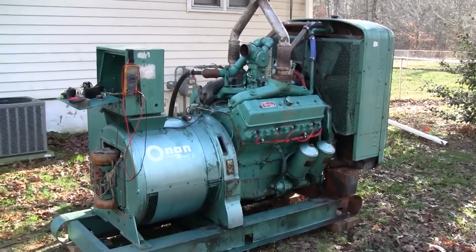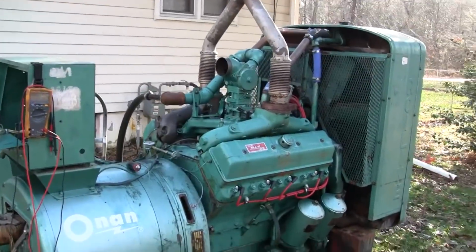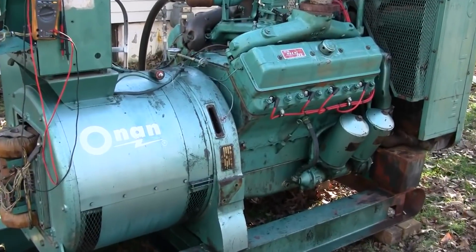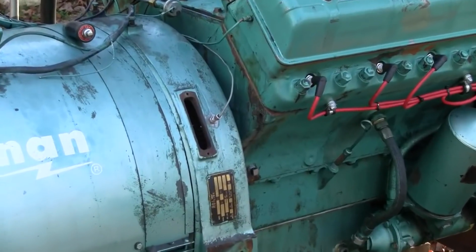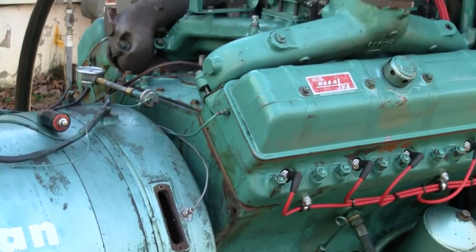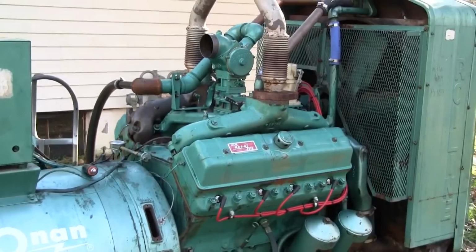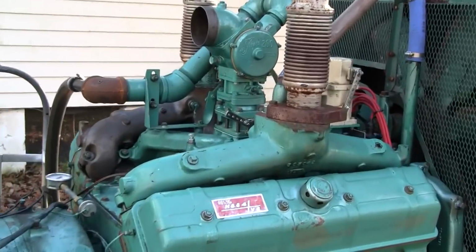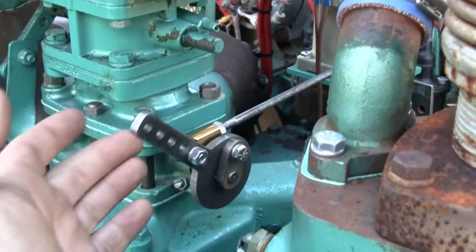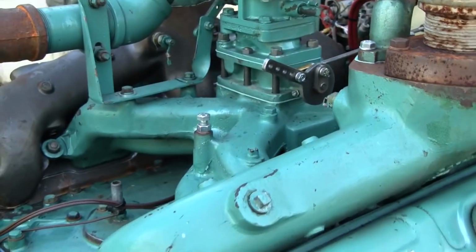Okay, we got the generator pulled outside and hooked up to gas. We got a battery hooked up to it. I've already had the thing running to warm it up. Now the first thing we've got to do is crank the engine over and see what the output of the mag pickup is at cranking speed. So the throttle, I guess if this wasn't obvious earlier, I'll say it now, the throttle rests closed. So the engine typically, in order to get it to fire, needs the throttle opened just to get it to kick off and start ramping up to speed.